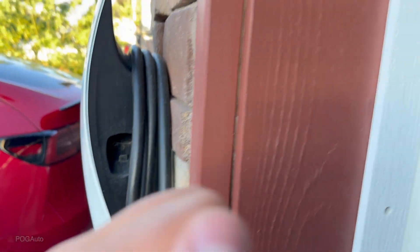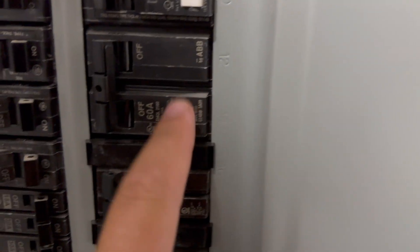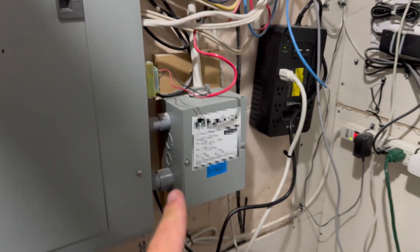From the main connector, it splits power down to a second wall connector and all the way across to a third. All three wall connectors are on one 60 amp breaker. You may ask how that's possible with only 100 amp service — YYC Power installed a black box unit right next to my electrical panel in the basement that prioritizes the house first and the cars second. When the house needs power, car charging stops; when it doesn't, power goes to the cars.